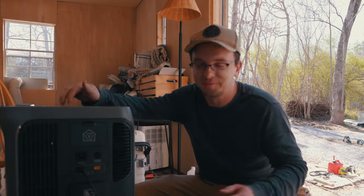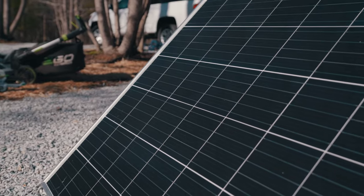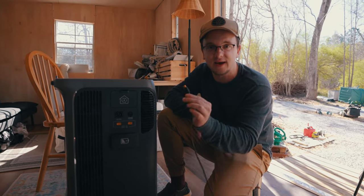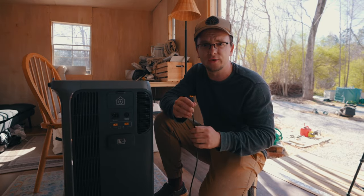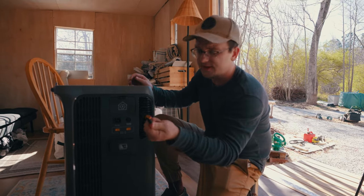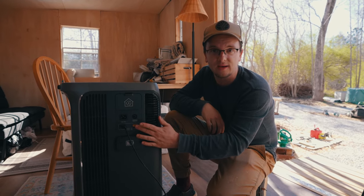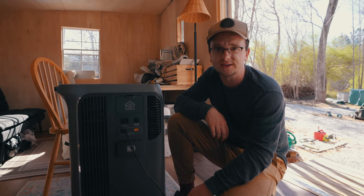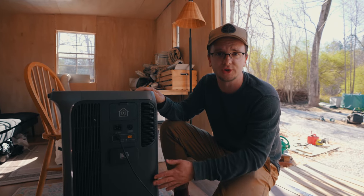This is the new off-grid location — it's very rural, very off-grid. We're currently charging this off of one 300-watt solar panel using a handy XT60 adapter. This XT60 adapter connects to the MC4 connectors on the solar panels. It simply plugs in right here, and you can actually plug in a second bank of panels — up to 2,400 watts of solar panels. We're only running 300 watts right now just to show this thing charging, but we plan to connect more solar panels in the future to charge it faster.